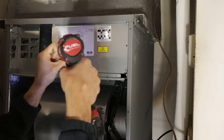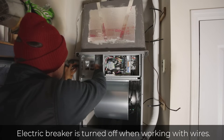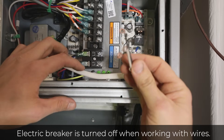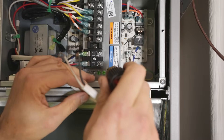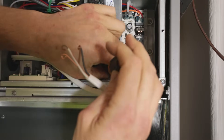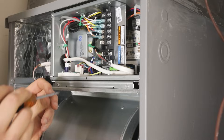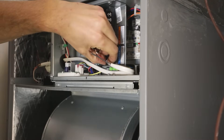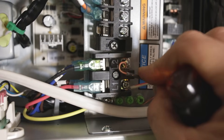Since I'm just replacing the old handler, it makes it easy to reuse the power that's already there. I stick it in the machine and attach it to the load inputs on the air handler. I attach the copper wire to the ground screw and snug that down. I'm running a 15-amp circuit because I'm not running an auxiliary heater, so my white and black wires are my load lines and they go to the load screws.